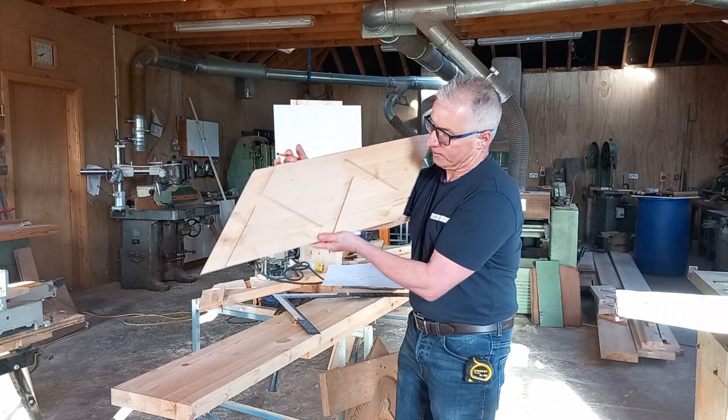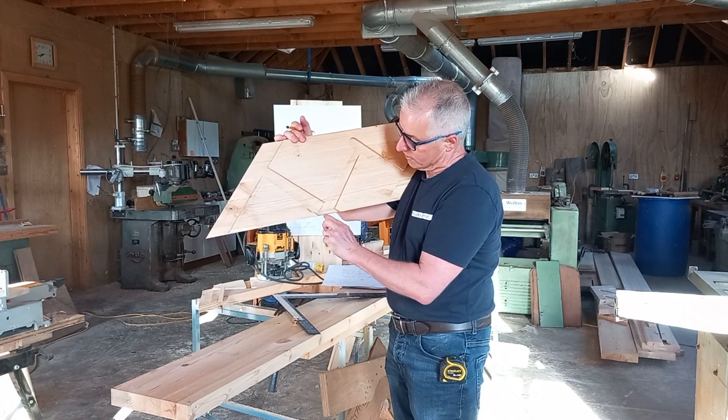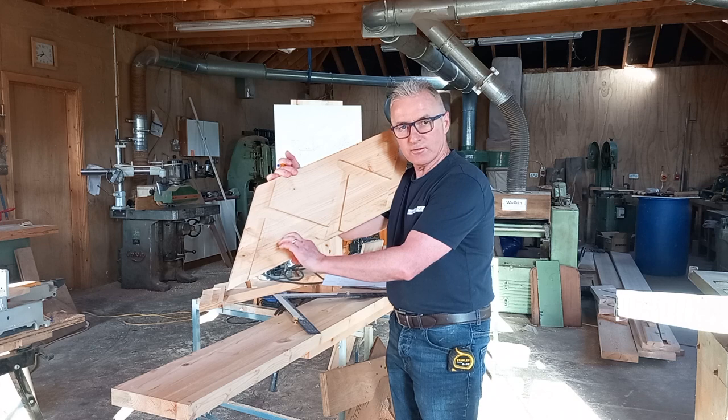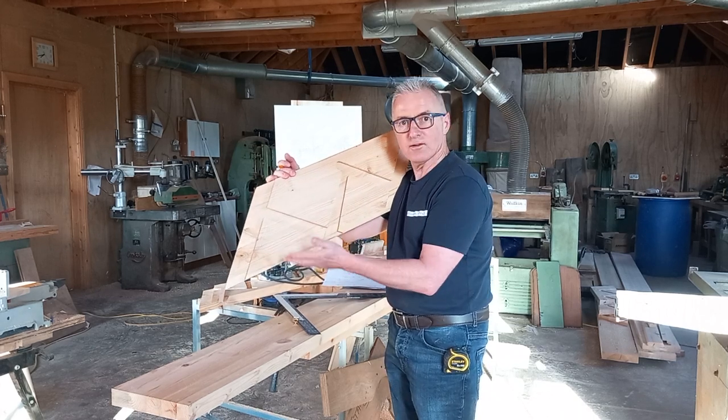And on the cut piece that we have here, you'll see there's a line of the back of the rise, and it's shown that it ends right here where my fingernail is. Normally you get away with about 36mm, or 1 3/8 in old money. For safety, if you want it to be in a little bit, make it 1.5 inches.